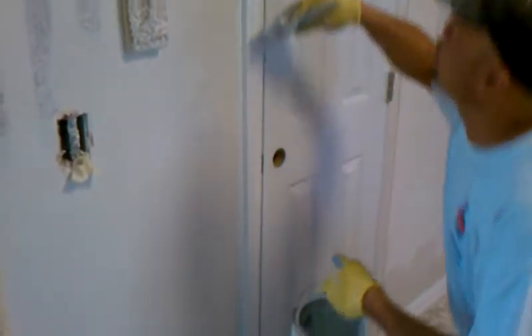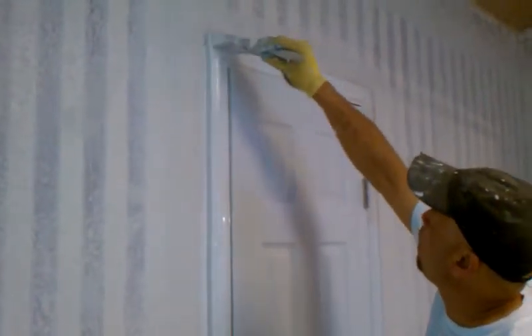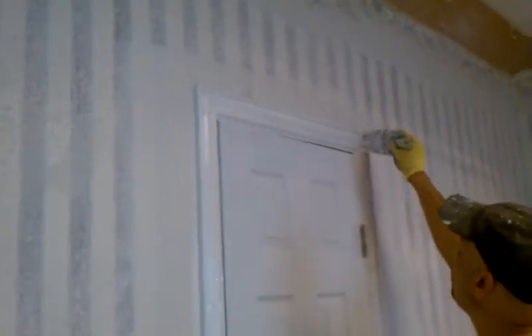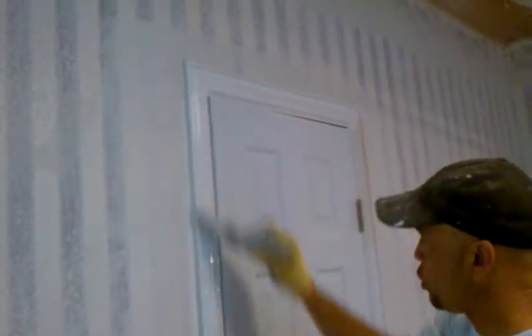You can use the same brush, but you just don't want to pick up trash right now. So then you move on across the top — these are tips on how to paint a door jamb — move across the top. You just go pattern, follow the pattern of the grain of the wood, and that makes a better finish.